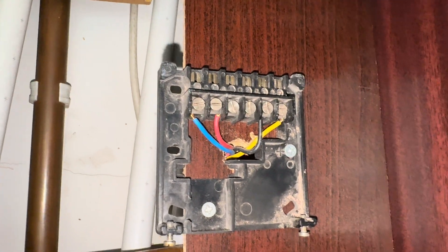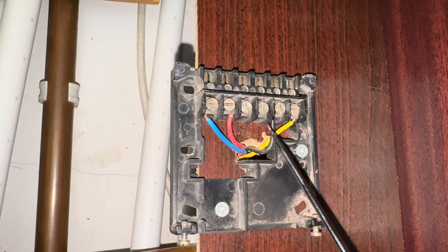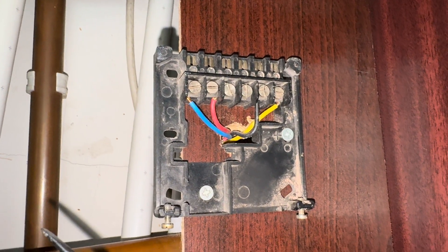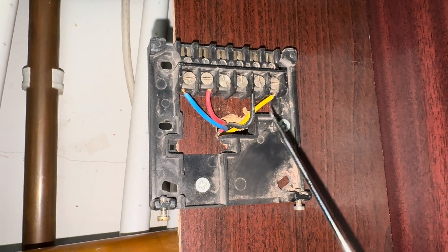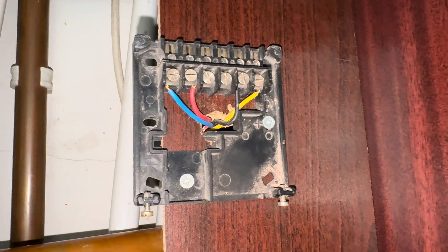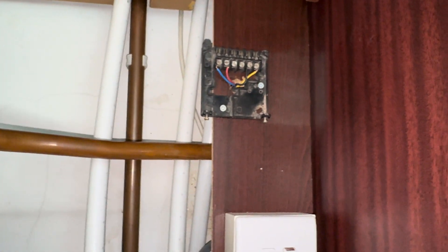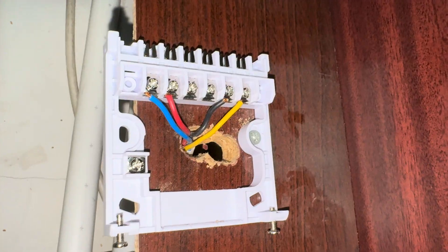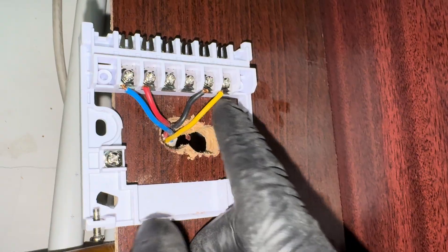Obviously carry out your safe isolation before you do this. I've got the power all turned off because I'm on the boiler install. Three is your hot water on, so when that gets power it will send power to the common on the cylinder stat. Then four is your heating on, which once energised will send power onto your room stat supply, which obviously once you turn the room stat up will go over to the zone valves. Should be a nice easy swap over — neutral, live, three is hot water on, four is heating on.